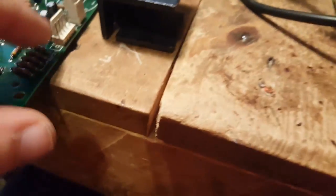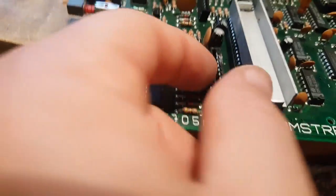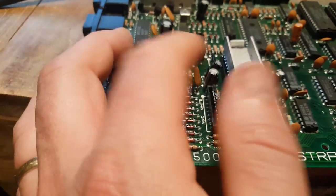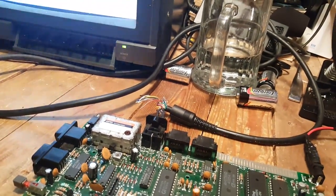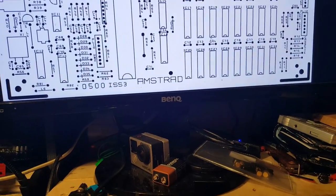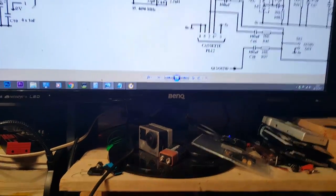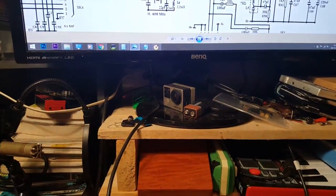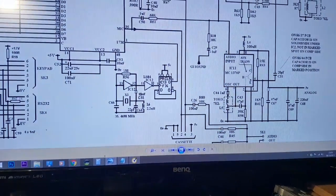I'm still facing issues with the tape player and I'm at a loss as to what's wrong. I'm getting signal on the heads and I'm getting signal at the pins as well — in fact I'm getting signals at the ULA delay. I don't have an oscilloscope to test the signal inputs or amplitude. Looking at the blueprints, pins two and four are going to the ULA, which is this big chip here, and I'm getting continuity on those two lines.